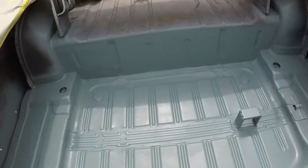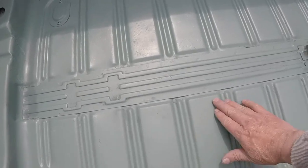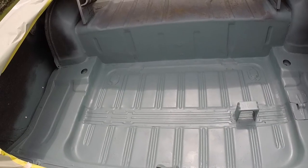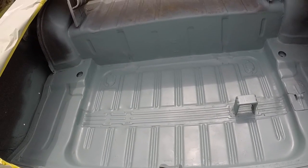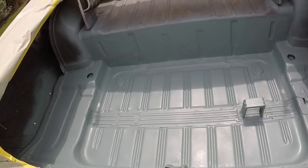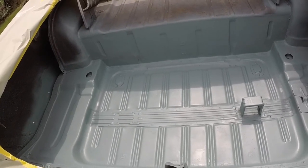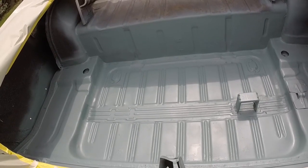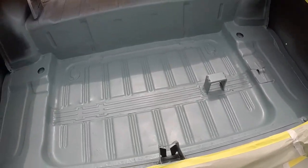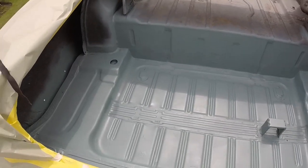Let me clean my gun and get my other gun. This is already completely dry to the touch — it's been maybe five to ten minutes. I'm going to let that dry and it says on the directions: a minimum of a half hour, maximum of 24 hours. If you re-coat after 24 hours you have to sand it. I usually always let primers dry 24 hours and give them a light sand, but today we're going to make an exception — let it dry a couple hours and shoot the spatter paint on it.